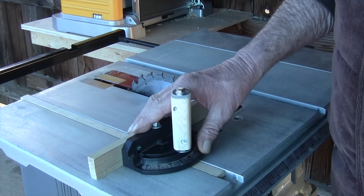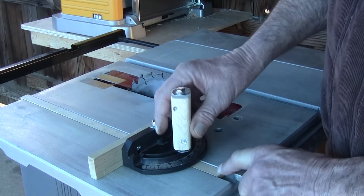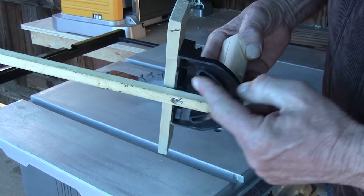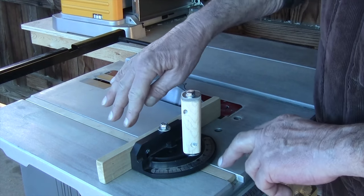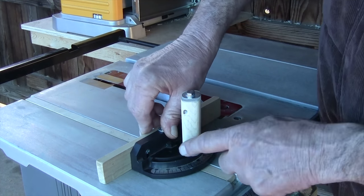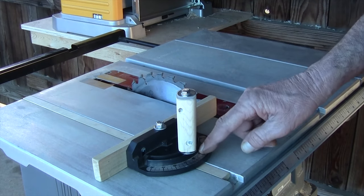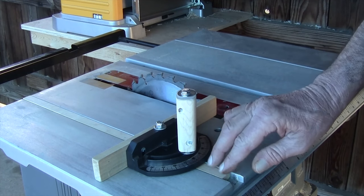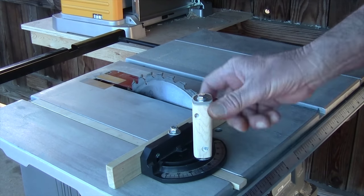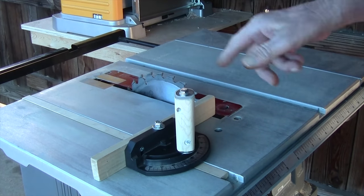Here are the final adjustments on the crosscut fence. First, make sure you hold this down — you do not want the plastic piece to touch the table top. Mine did, so I put a washer here and another washer there, which raises it up just a bit. Second, I put about four pieces of paper under each end of the fence, set it down on them, then put the screws in — now it moves just a little bit, which is what you want. You don't want the plastic or wood hitting the table top, just the miter bar guiding it. These fence boards were a little longer, so I raised the blade and cut them off on each side so you're really close to the blade when you crosscut.